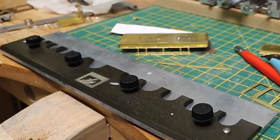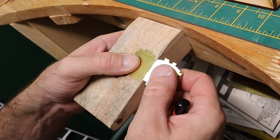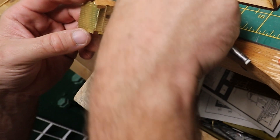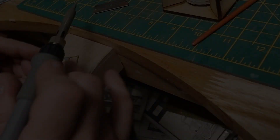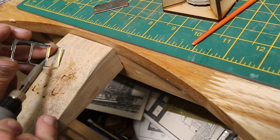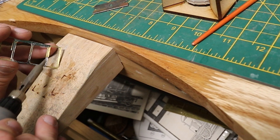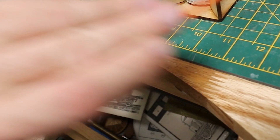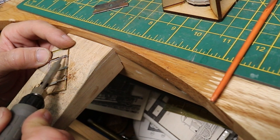We're going to switch things up a little bit here — I'm working on the second of the two sides of the cabin. On this occasion I just folded that over my bench pin. You can see we've got this overlay which needs to be soldered onto there — this is the part you saw me embossing the rivets on a little while ago. The first stage in fixing these overlays is to tin the back of the overlay, which I'm just doing here with a soldering iron. Then the next stage is I'm going to use a tool called a resistance soldering unit to solder that onto the cabin.